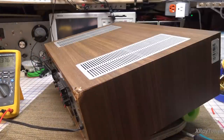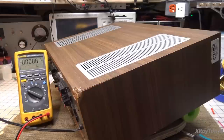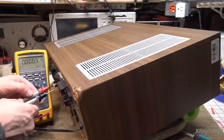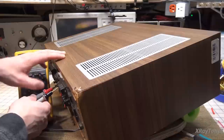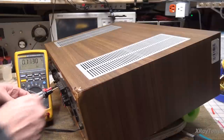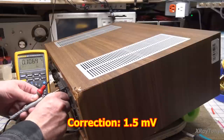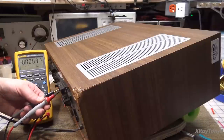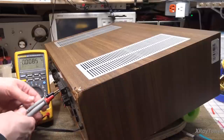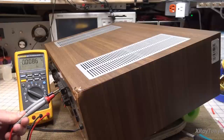I'm going to go to 50 millivolts — well, let's go to volts first just in case there's something really wrong. Speaker A. And that doesn't look bad at all — looks like about 15 millivolts. That's good. Left channel — about 8.8 millivolts. Actually 1.5 millivolts and 8.5 millivolts, so I was off by a decimal. 8.5 — beautiful.